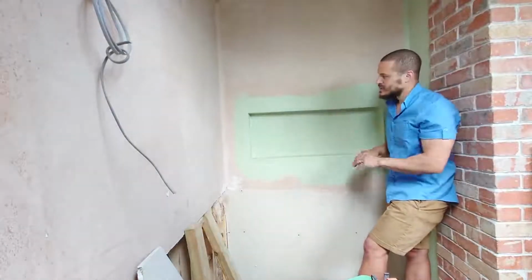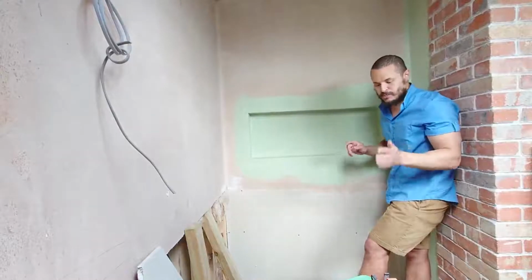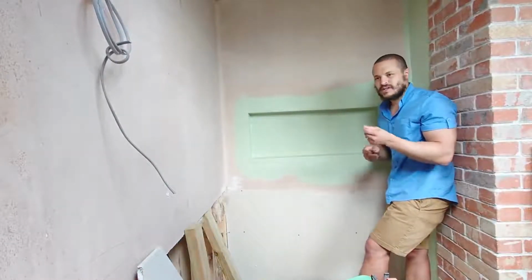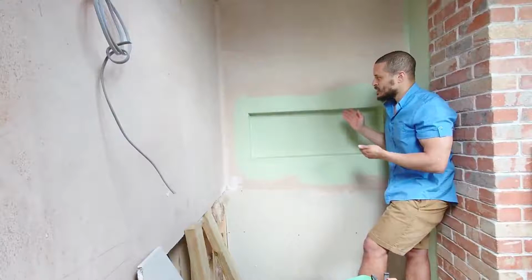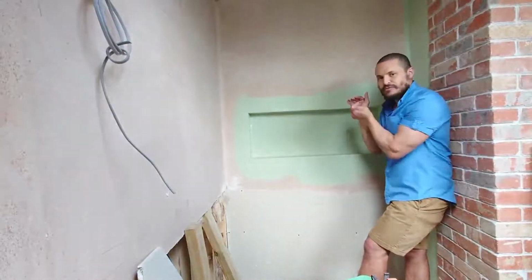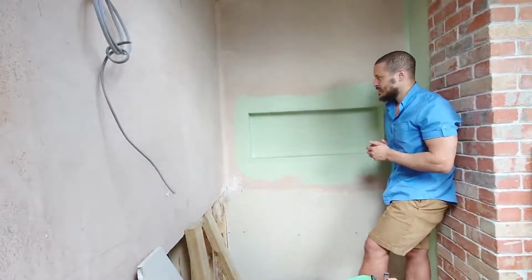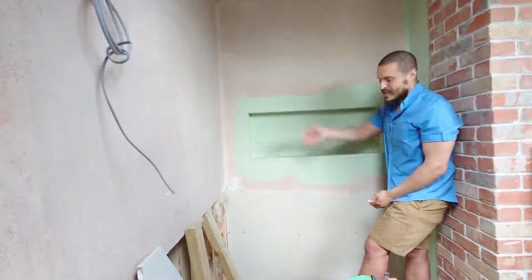So after I put the plasterboard in, because it was a bit of a mess really with the different cuts and things, I then used scrim tape to fill in all the gaps and the cracks. That was because the product itself, the Hydroban product, can only go so many mils, and also adding in the scrim tape, the stuff used for plasterboard, allows for a little bit of flex, so hopefully cracks don't form, which again would be really minor for the most part. And then the last step was 2 layers of the Hydroban.